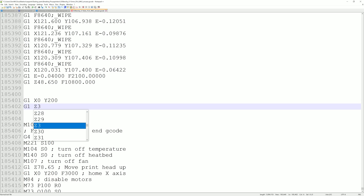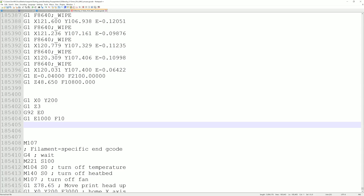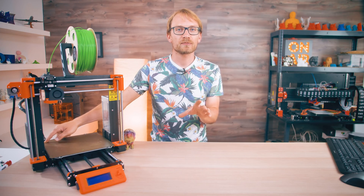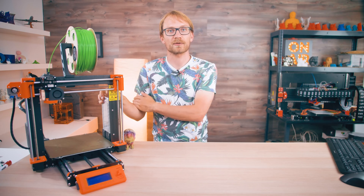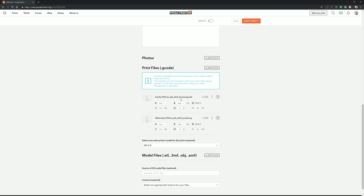The encased version moves the hotend to the back of the printer and then extrudes one full meter of filament into one spot right above the bed — that should create a proper blob, and it did. The scratched G-code moves the hotend to the back, just barely touching the bed, then makes the printer believe it's actually still one millimeter above the bed and then tells it to move to zero again — effectively shoving the nozzle one millimeter below the bed's surface, and in later iterations actually more than just a millimeter. Both of these types of G-code exploits uploaded to PrusaPrinters without any issues.